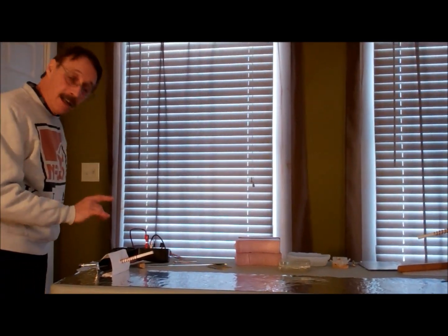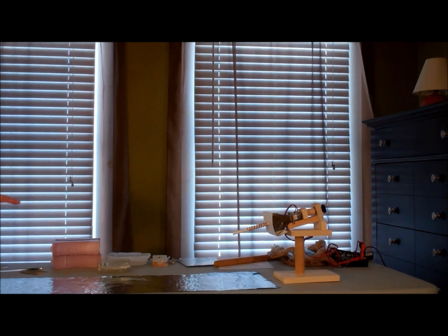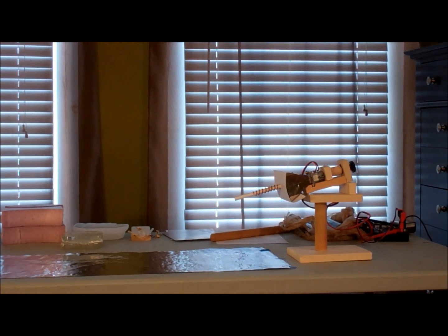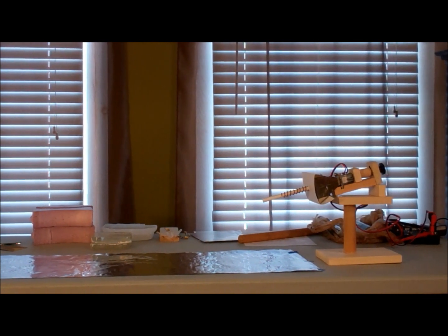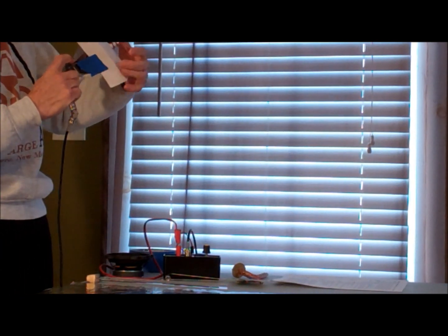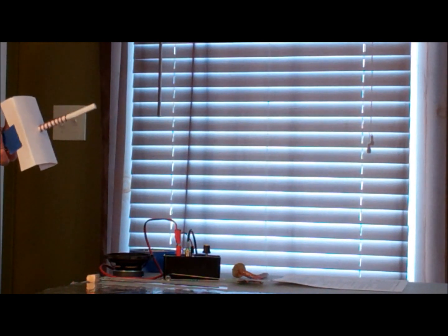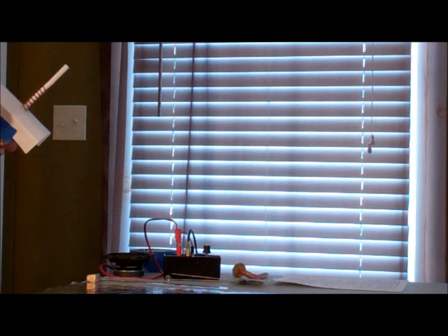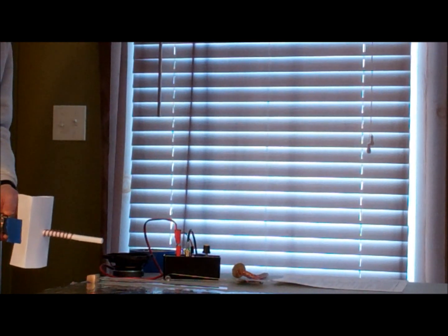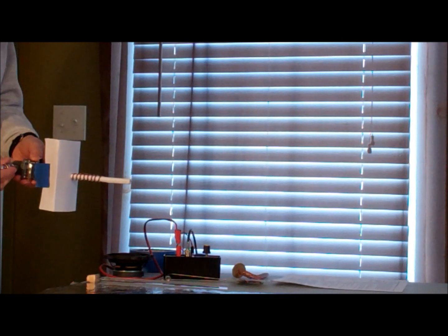I've added two helical spirals into the horns. At that end you'll notice it's pointed down, so some of it will be reflected and some will be projected straight out, giving us an interference pattern again. Now because I used cardstock paper on this, there will be some linear polarization. I'm going to turn it horizontally to get rid of the linear polarization coming through the paper, and hopefully we'll just get the signal coming from the coils. It's nearly constant.